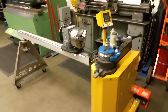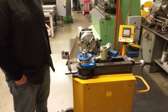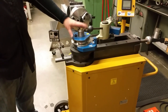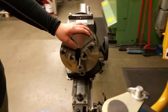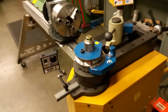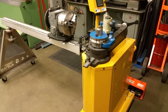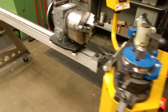Let's take a look at your bending machine. Paul, you want to tell me about your bender? Yeah, this is made by Rush Machine Design out of Wisconsin. It's the RDB 250 CNC tubing bender — two and a half inch capability, non-mandrel rotary draw. We've got the index table on it so we can do out-of-plane bending, and full CNC capability with up to a hundred programs stored in the system. We bend all of our cart handles and any tubing products we make on it. How much crush do you get with the non-mandrel? Not too bad as long as you stick to about three times the diameter of the material you're bending. If you go anything below that you'll get a pretty significant pinch.